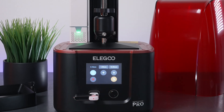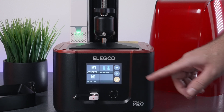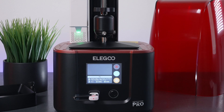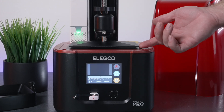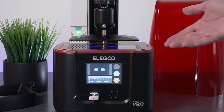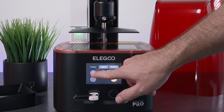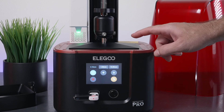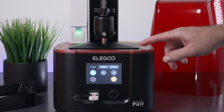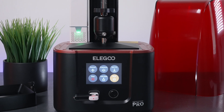Let's plug in the thumb drive — note it doesn't have a light that glows — go back, and click Print. We've got a couple of rooks available, so we'll start one. You can see it starts pretty high up because of the large offset we set. I'll go ahead and stop this, go back to Manual, Home it, and looking at it eye level I can see it's a little too close. I'll raise it 0.2mm, set that as the new offset, and that's how you level the bed.